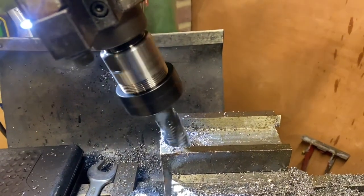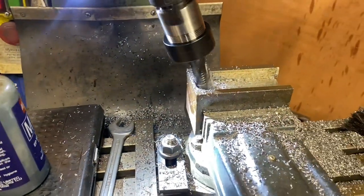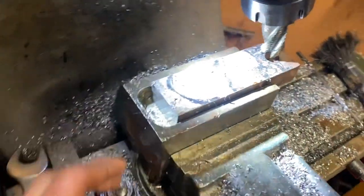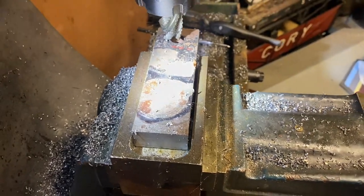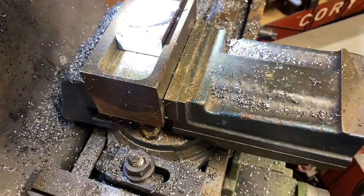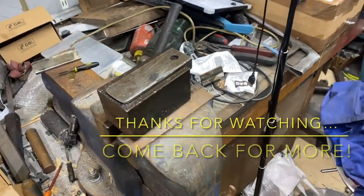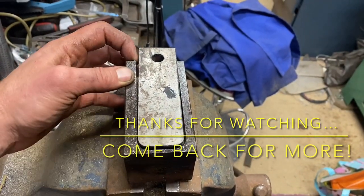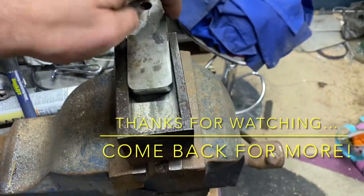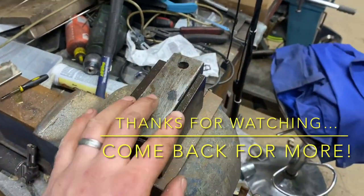That's putting the angle on the back of it. That fits — hopefully that's enough clearance for the sheet material. I just need to radius the end so that meets the end and put an angle on it as well. Every time I've said to myself 'that's enough, I'll carry on tomorrow,' I've just got the next bit ready and done it. I've just filed radiuses on those corners and it fits in nicely. That can now go to Alex to form the shovel blade.